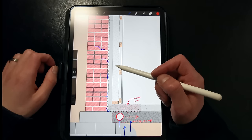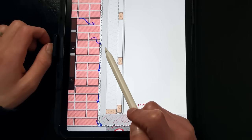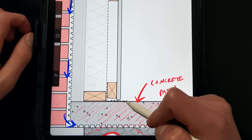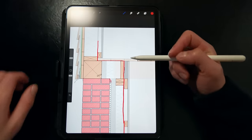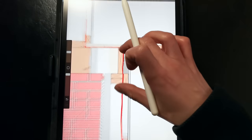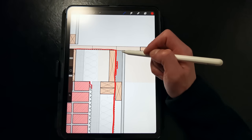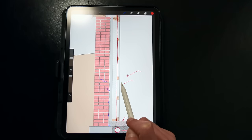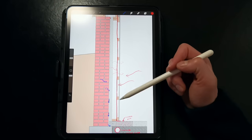In this particular detail, we've chosen an alternative strategy using mineral wool and a taped smart vapor retarder membrane so that we can have a continuous air barrier from the foundation walls all the way up to the framed walls and to the roof assembly. We have rigid mineral wool installed against the dimple mat, rigid mineral wool batts within the framed wall cavities, and the smart vapor retarder membrane stapled to the studs, taped to the slab, and extending all the way to the top of the wall and up onto the joists. The smart vapor control layer will prevent vapor from diffusing from the inside outward, but allow moisture to dry out of the cavity to the interior if conditions get wet or humid inside the framed cavity.